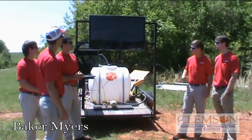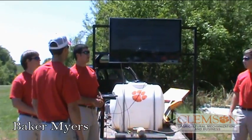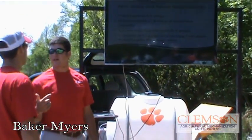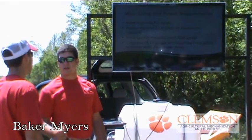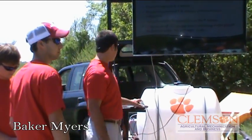When we started off, we had a 20-amp breaker for the pump and it would flip the breaker, and we couldn't figure out why. What it was is whenever you turned the pump on, it had a spike in amps that would flip the breaker. So we had to go get a 30-amp breaker just to run the pump, and we got it in our breaker box.